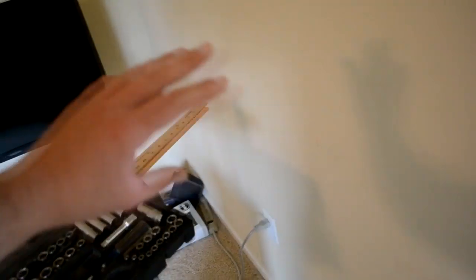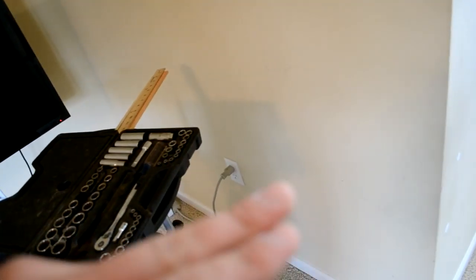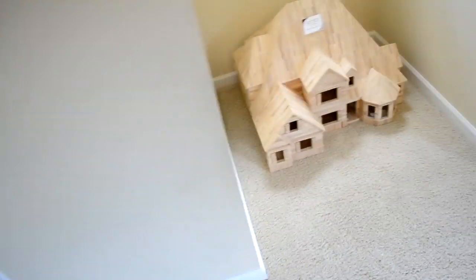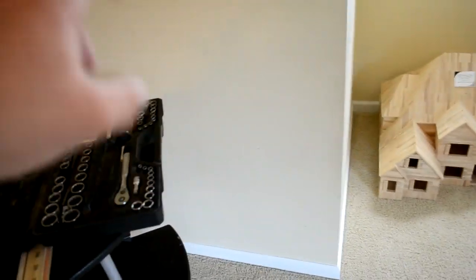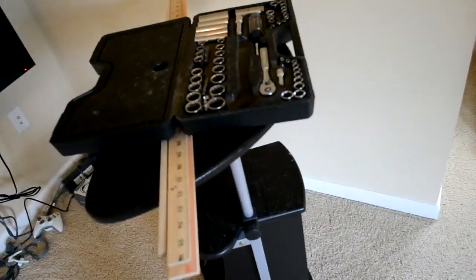I don't know if those are supporting the rafters at all - I know the ceiling probably is, as a tie going across. But I'm guessing those two support it a little bit. If you were to take out the studs temporarily, it's not like the roof is going to collapse. So I'll probably take the studs out and then box it in like a window - where you got your bottom sill, I'm going to put a header. And it'll still be able to rest on that, and there'll be just a big opening like a window in the middle of here. And then I'm going to build a box that goes back into the wall. Actually, if I do it right, I can make it so it fits - you could display it. But I think I'll just use it as storage. Put some trim around it, paint the inside white.